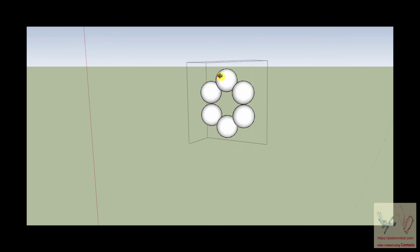Remember, if this ball bearing is turning this way and this ball bearing is doing the same thing, then the motion of this one right here is that way, and the motion of this one right here is that way. They're scrubbing on each other. It was my hypothesis that if this is an inexpensive, low speed, low pressure toy device, it's not a problem. You make these with enough space in there that they're sort of bouncing off of each other and rubbing each other and just pushing each other around. In other words, you have a sloppy actuator, a sloppy linear actuator.